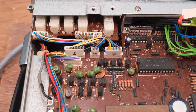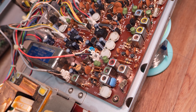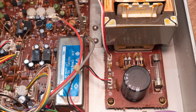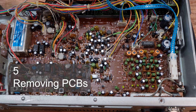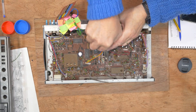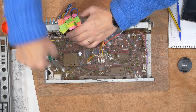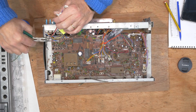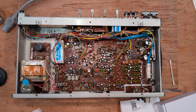I'll remove the coaxial cables after making a careful diagram of their connections, as a mistaken reconnection could be very damaging. Joining the two PCBs together and to the various controls and sub-boards is an extensive wiring loom, reminiscent of an older-style car. There are a great many connectors which had to be released, and I photographed them extensively from multiple angles to ensure accurate reconnection. Over time the wires had stiffened and retained their shape, which would help during reassembly.